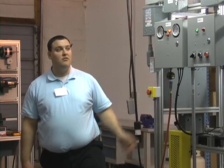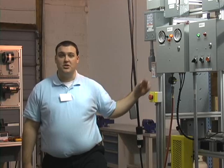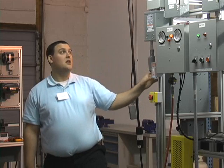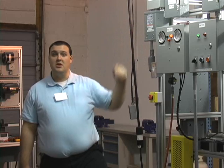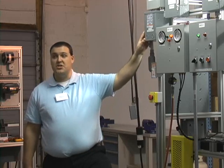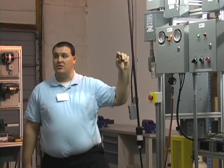The students start off by building the frame and installing electrical infrastructure, which includes a master safety disconnect for the instructor, a standard breaker panel, and a series of cable trays and wire ways for all the power distribution. The input power to the unit is 220 3-phase, which gets distributed through the master breaker panel into a station transformer that transfers that power to the 120-volt control voltages needed to run the rest of the system.